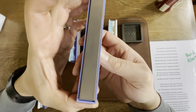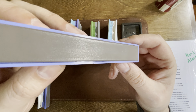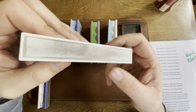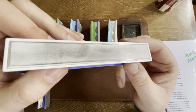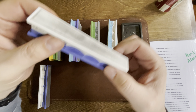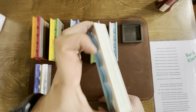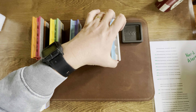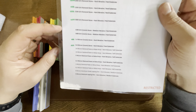This is the 1.4 micron ceramic stone and the 0.6 micron ceramic stone, and these were also part of the ProPak 2. So there's the 1.4 and the 0.6. After the 0.6, I would come back with my glass — my lapping film on there — do the next wave. That's just kind of bridging the gap between.